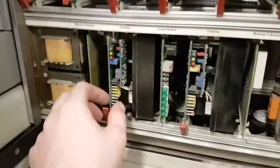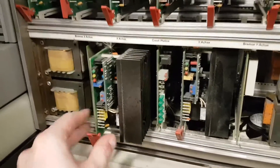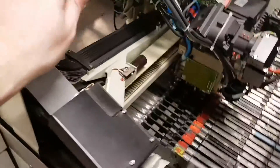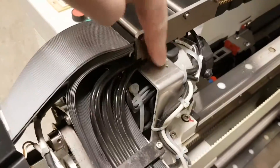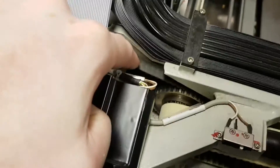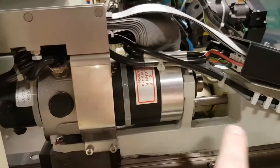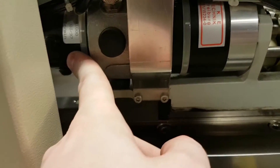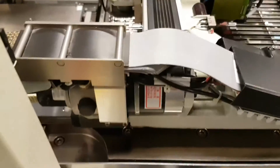So let's have a look at the X-axis, which is going to be the smaller motor — the motor which is on the gantry. Up here we have the motor which runs the gantry. That's its encoder. That's its drive, which is going to a belt reduction. So this is the motor itself — it's not big, it's just a DC motor. I'm pretty sure this isn't even a quadrature encoder; I'm pretty sure this is just a single pulse. It's old technology.